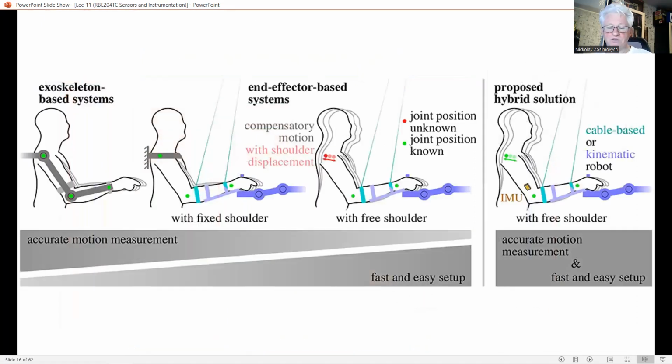In an alternative approach, to find the end-effector position, the light source and detector from the previous example are interchanged. The sensor or camera is mounted on the end effector, and a source transmits a light pattern in the direction of the sensor. The pattern can be a light spot, a line when emitting a light plane, a crosshair, or any known pattern. A 2D pattern, in combination with a matrix sensor, allows the measurement of the position and orientation. An algorithm is used to obtain the required information dealing with the measurement of the end-effector position.